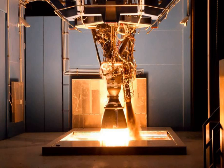In May 2016, SpaceX announced plans to further upgrade the Merlin 1D by increasing vacuum thrust to 914 kN and sea level thrust to 845 kN. According to SpaceX, the additional thrust will increase Falcon 9 LEO payload capability to about 22 metric tons on a fully expendable mission. SpaceX also noted that unlike the previous full thrust iteration, the performance increase is solely due to uprated engines with no other significant vehicle changes publicly planned. In May 2018, just before the Bangabandhu-1 launch, Elon Musk announced that the 190,000 lbf goal had been achieved.